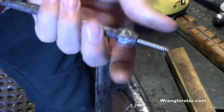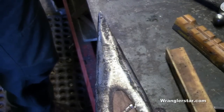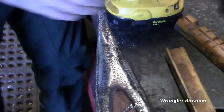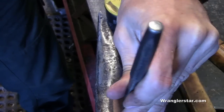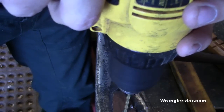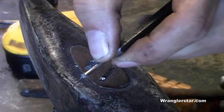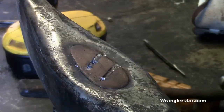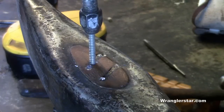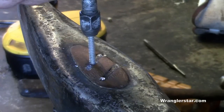We're going to use this to pull out the wedges. We'll take a really small drill bit and drill right in the center of the wedge. Usually these step wedges are really soft. Let me center punch it lightly first so we drill right in the center. I've got my hole drilled — you can see it's about that deep, probably deeper than needed. These are really easy to drill, they're super soft. So let's thread the screw in here — careful not to break it off, go in as far as we can. That's pretty good.